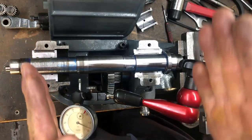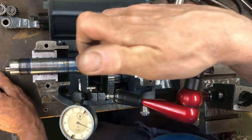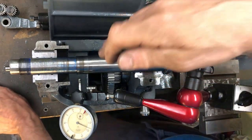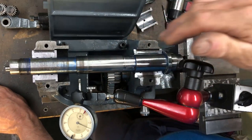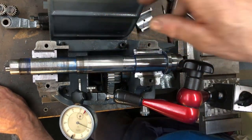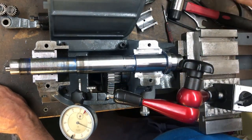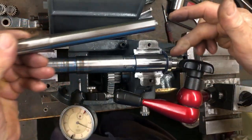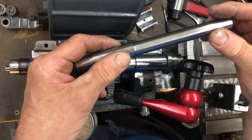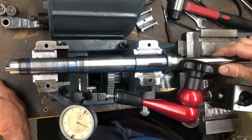You push on either side to get it correct, then snug down the bolts. Then you will have to test on top here. I like to test with the spindle in situ now, because I know this is parallel with the bearing seats. I don't know precisely how good the center is, so I'm also testing with the center, because this is where you put tooling — spindle-mounted or taper tooling.